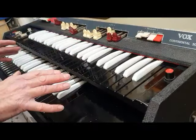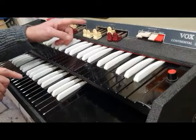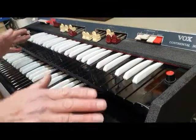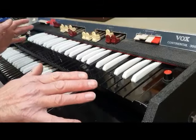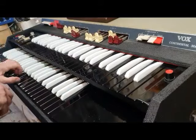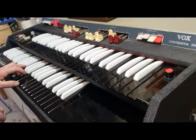And every note triggers — every key and all the footages right across the actual organ. It's taken a long time to get it right and it's involved 1,100 cases of soldering and replacing the top manual. So it's a fully working example.